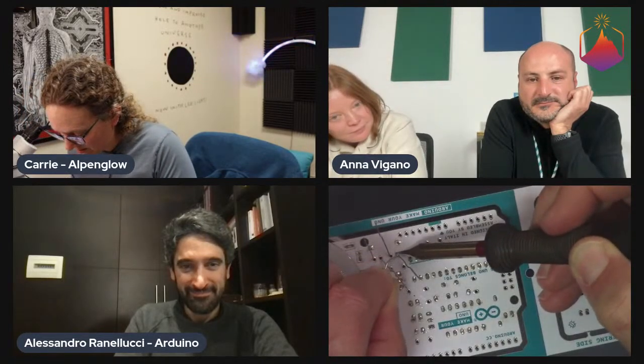All right. I'm going to do the same kind of thing here, where I just solder in one of these legs. And then from the underside, I'm going to push up a little bit while I reflow that leg, just to make sure that it's flat and seated nicely. And then solder the other leg. There we go. I'm going to clip that one so that it's out of the way too. And then do the same thing with this. Cool.